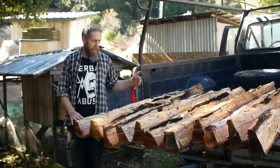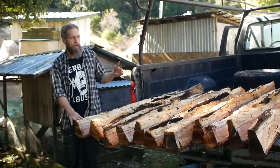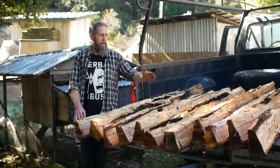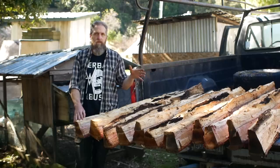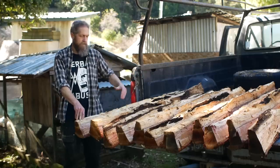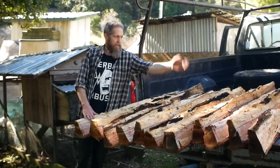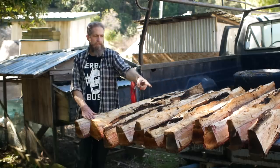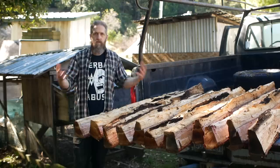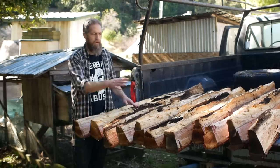This is a pretty good haul here. Most of these I could get an axe handle that's at least 32 inches — it's just a matter of dealing with knots or wavy grain where I might want to cut it off. Almost all of them have at least a 30-inch handle, just a few don't. If any are straight all the way through for a long distance I'll keep that full length. But this spot is dry and windy — they're going to start cracking pretty fast. I need to seal both ends of every log before I do anything else.